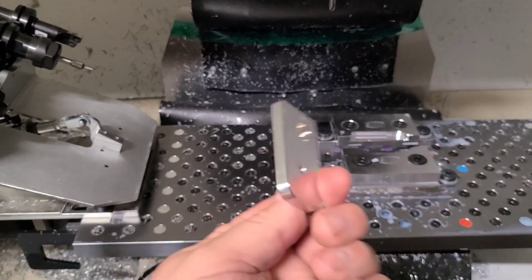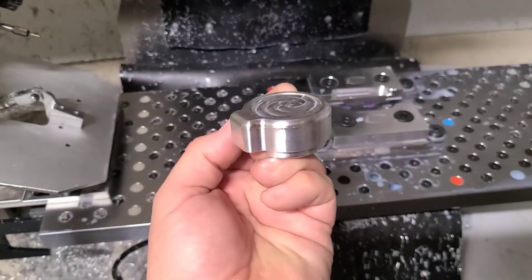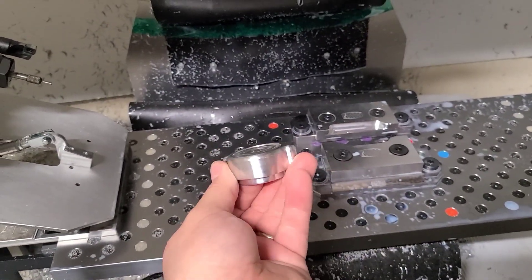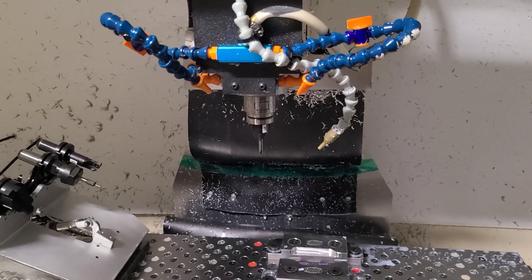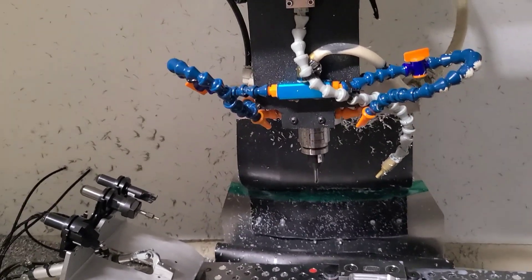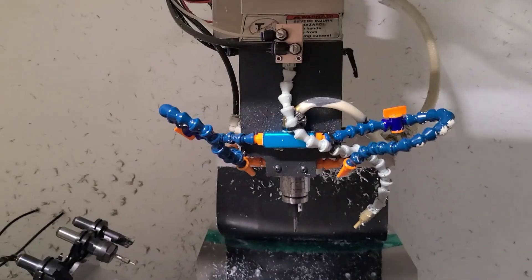To give you an idea of what I make on here: I make these brackets and little billet caps, among other things. The machine does a really good job — it's pretty fast. It's set at a conservative 105 inches per minute rapid and feed speed. You could go a little higher, but with a stepper-based system you always want to under-rate so you never have lost steps — and I've never had the machine go off track or lose steps during a cut job.